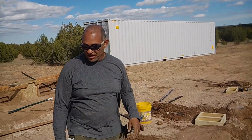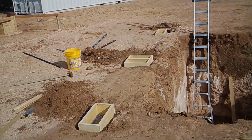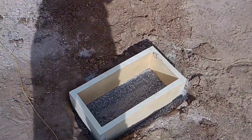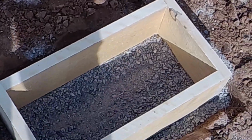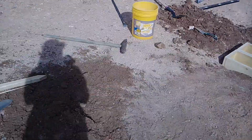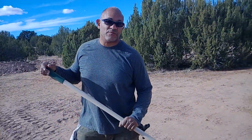That makes sense. So what we did is we went about 6 inches down into the ground, laid a foundation to get them level, and what we're going to do now is fill them with some cement just to create a level foundation, so when we do put the block on it, it'll be a starting point of levelness.